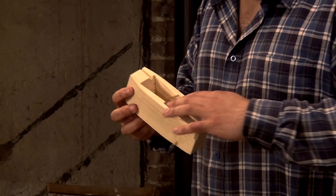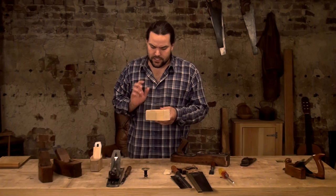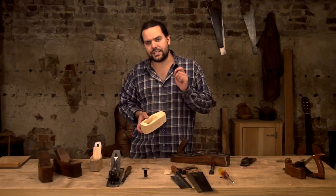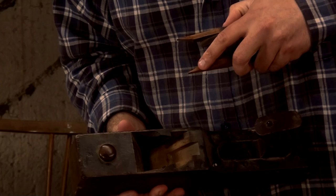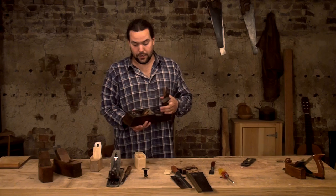Then we just have to do a bit of fettling. The build itself was so simple and it yields a very impressive looking plane — fool your friends. But the point is that we want to use a plane, not just show off. I did come a little bit stuck though when I got to the wedge, because whilst I could cheat with the cutout, the wedge still had to be very skilfully made. The fundamental part of the wedge is that it matches the cutout perfectly — this piece has to follow down the wall inside to the T. The secret to a nicely adjusting wooden plane is all in that wedge, and even on a very well made new plane you may find yourself still having to tweak that wedge from time to time.